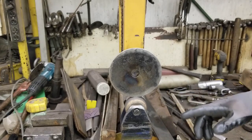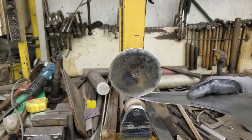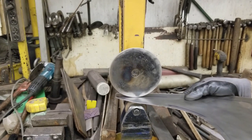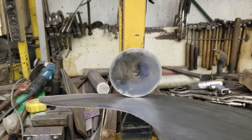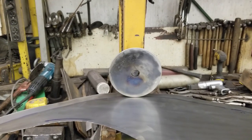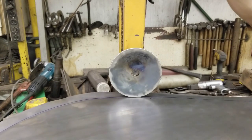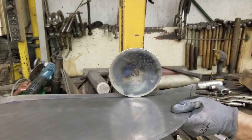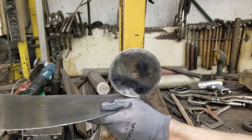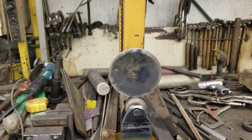The beauty of this tipping wheel is that I can take and push down into this skateboard wheel — yeah, it's a skateboard wheel — and very lightly run over top with just a little bit of pressure, running over top of that Sharpie line right there. You can push it or you can turn your hand crank. I'm pushing down a little bit harder than I normally would because I want you guys to be able to see the line on the other side. And there you go — you can see that line right there. So now that is our reference for us to push down with the offset wheel to give us a flange in that area.